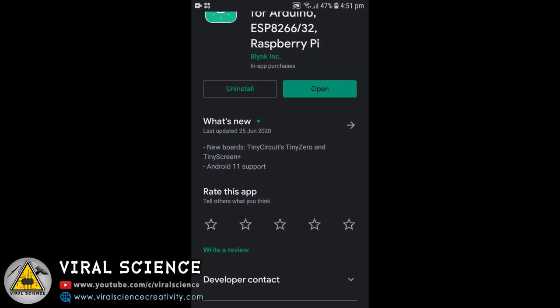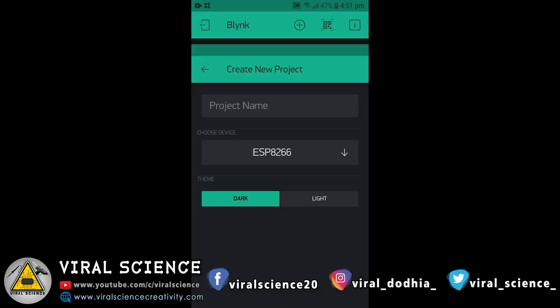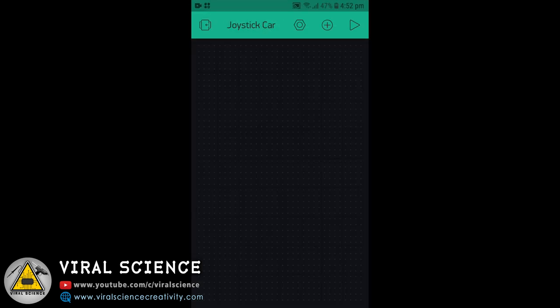Now download the Blynk application from Play Store or App Store. Open it. Create your account and click on New Project. Give your project name. I'm giving Joystick Car. Select the ESP8266 board and create.